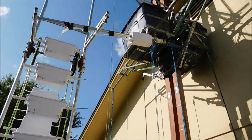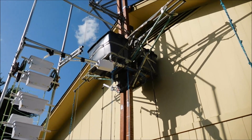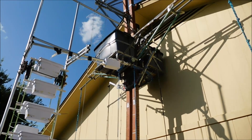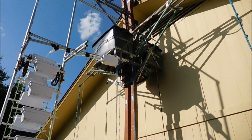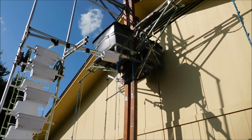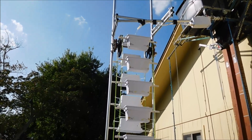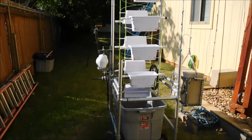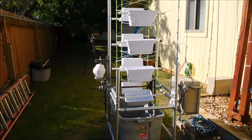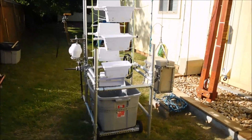With this particular setup, we have about 60 or 70 gallons of water up there. So I ought to be able to get 300 minutes, or about five hours, if you have it adjusted properly and the flow rate is set right. That's plenty of time — that's almost two nights worth of light, depending on your sleeping habits and what you might be doing during the night.